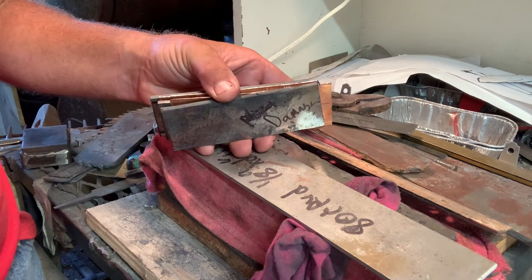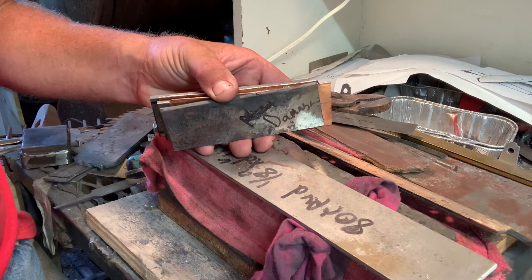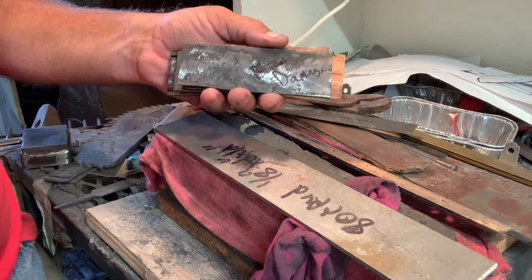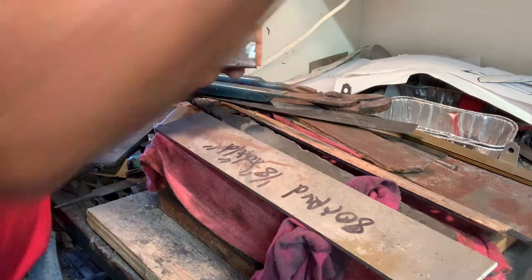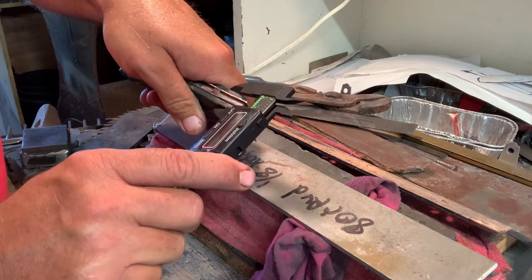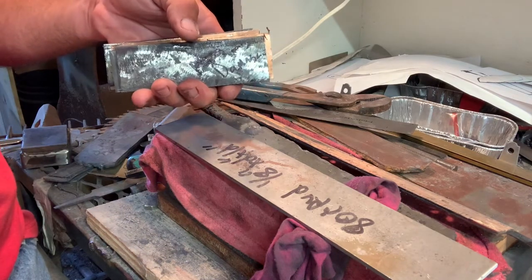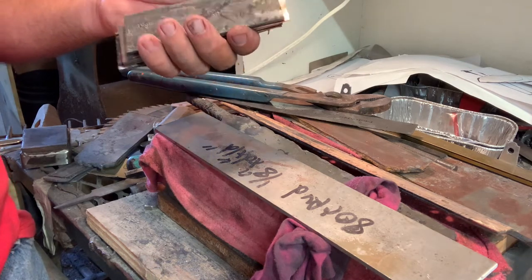If it gets big enough, I'm going to make a funky looking dagger that was requested. That in itself is going to be a challenge, let alone doing a QMI with it. I'm not positive I'm going to be able to get enough out of it, but this is what I had. The stack is five inches by inch and a half wide, and I think it came out to about 0.59 — just a little over half an inch thick. I think I can stretch it out to about 11 inches being a dagger, with a hidden tang.